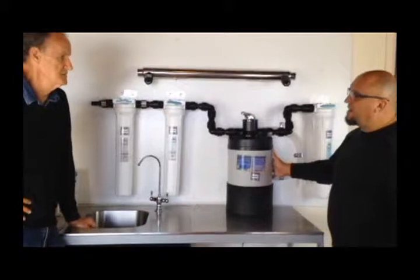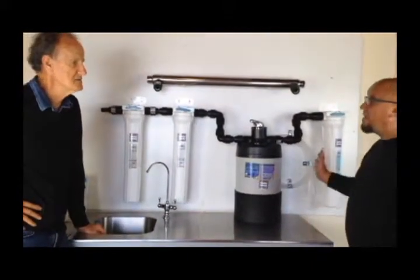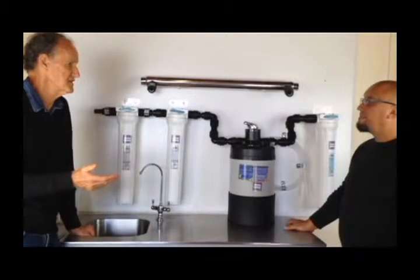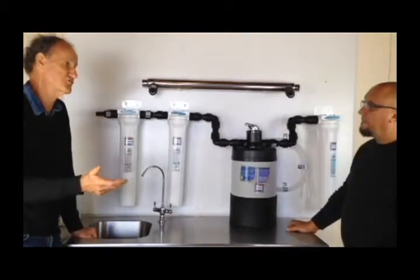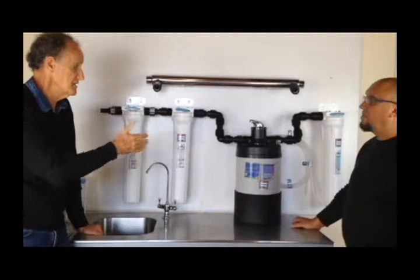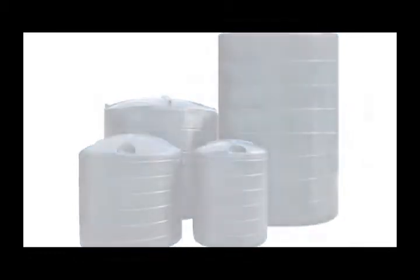But if you've got a plastic tank where you're going to have a very acidic water, that's going to affect the pH. If people have got any copper staining due to the acidity of the water, we're lifting the pH enough to at least stop that. Very few people realize what effect plastic or fiberglass tanks have. People also think that rainwater comes down neutral — it doesn't, it comes down acidic because it's going through all the CO2 and crud in the atmosphere. I've had plastic tank people come in and you're testing at pH 4.